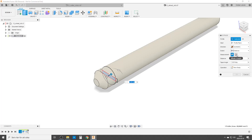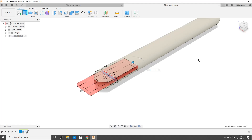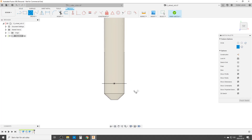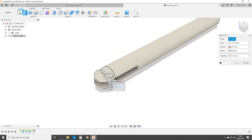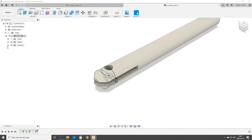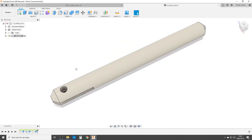It's gonna be symmetric, it's gonna be a round wheel — I do the whole length, it's gonna be 30 millimeters, and then I need a small gap plus one millimeter round. We need a second sketch on this plane — this is really not necessary, it's mostly a cosmetic thing. Let's find the profile, do it symmetric, and let's have a look. Turn off all the sketches and we have ourselves a small handle with a hole for a rivet. I'll now change the materials — you can do that yourself if you want.